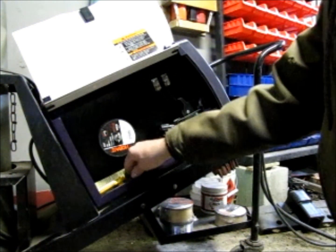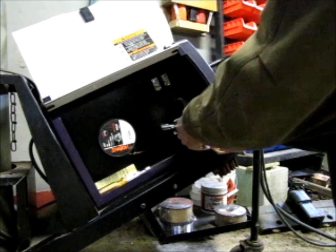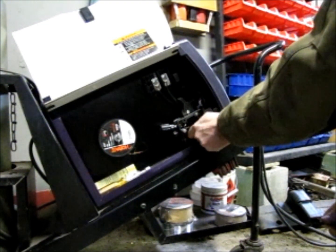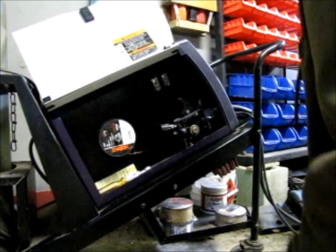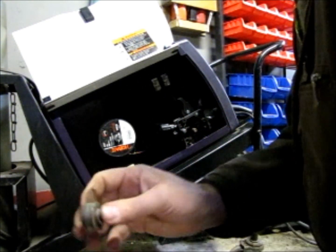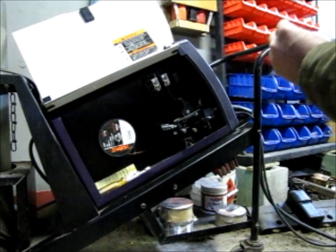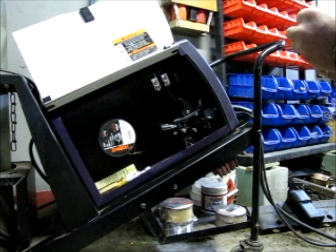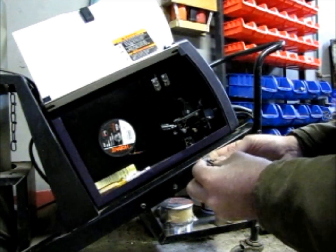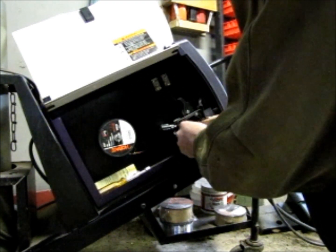Since I'm going down to that fine wire, I have to change my feed wheel. You just pull that little straight slot out of there — hopefully that's shown up on the video. It's got two different diameters of guides on there. Just flip it around so that the fine one is on the other side. On my wheel it tells you what it's for — it says twenty-three thousandths, twenty-four thousandths. So make sure that's the one that's lined up underneath the wire.